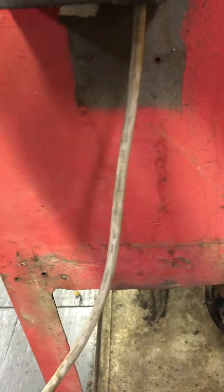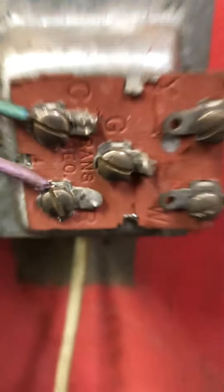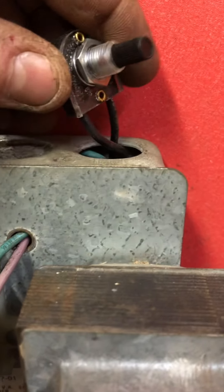It pulls the coil in with 24 volts off of this transformer. This is my thermostat for now — it's just a rotary switch. I redid these wires in here; they're all new. I need to get longer ones. This part is still original — I need to replace it, but it's only 24 volts, so not really that critical.